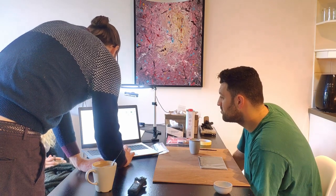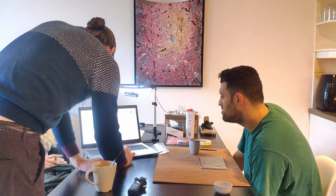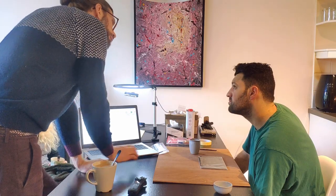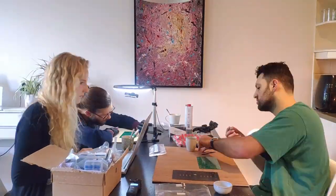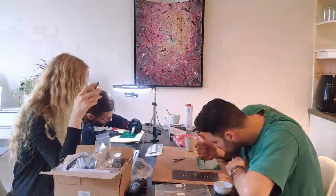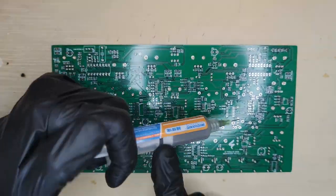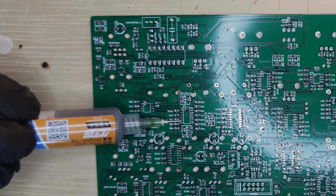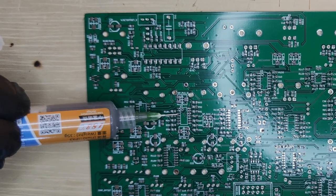We'll just start with the resistors. We're going to do SMD placement and bake the whole thing in one go. The first step is to use a syringe of solder paste to apply a tiny dot of solder paste to all of the pads for passive components. For the ICs, apply a thin line of paste near the outside of the footprint on both sides.